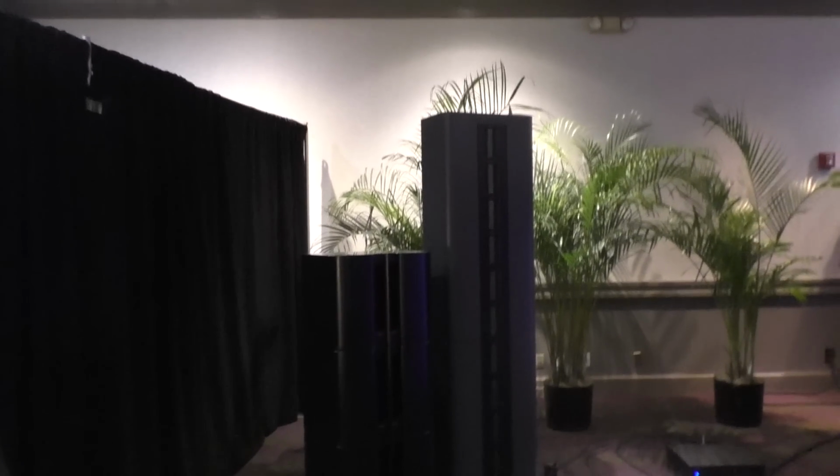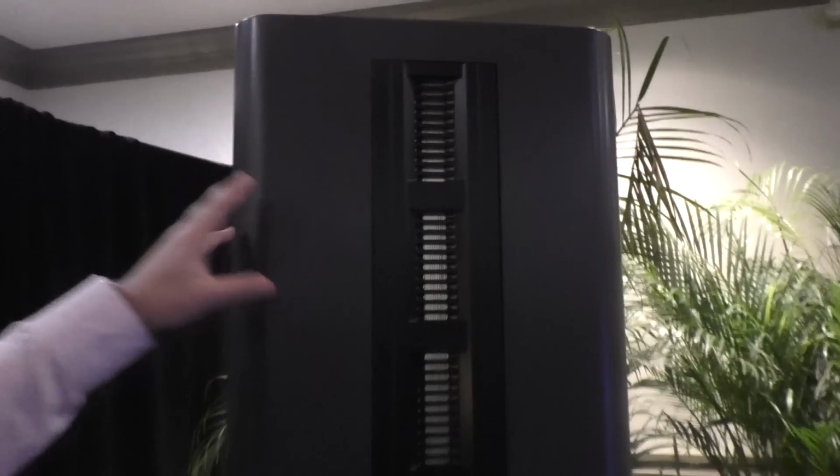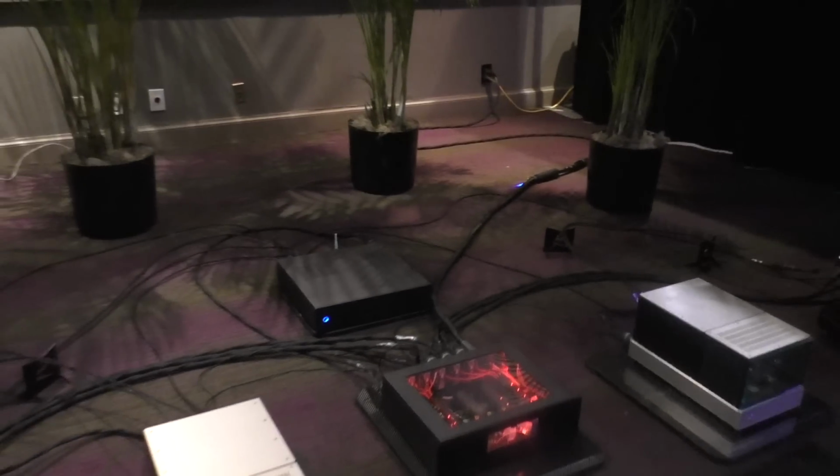And those are those like Heil? Yeah. So these are modified Heil drivers. Mike Kalelis is the engineer. This is what Harry Weisfeld has at home, but this is the 120 hertz up to 30 kilohertz Heil driver. It's done an array of 12, and then each of these boxes has 2 10-inch woofers. Now what's special about this system is that Trinov box back there behind the power conditioner. So he can do DSP and room correction on this. So really, it's amazing technology.